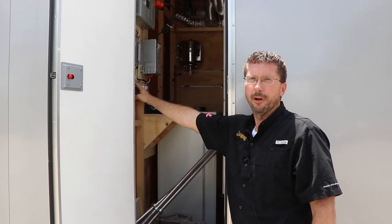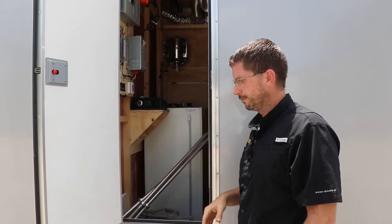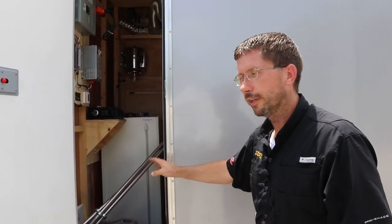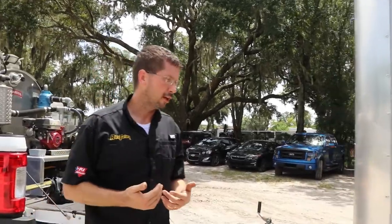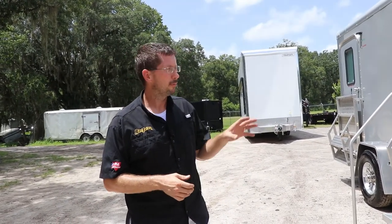The other switch next to the water pump is for the closet light — flip it up if you're hooking up at night with 110 connected. Once power and water are connected, go in and test the unit: test the water faucet, test the toilet flush, and make sure water is coming to all stalls and sinks. Every time we set up a restroom trailer we install new trash bags, do a triple sanitization, check lighting and 110, and do one final check around. At this point the restroom trailer is fully set up. Do a last check on paper towels and extra toilet paper, and you're all set. Thank you for watching the Right Trailers channel.